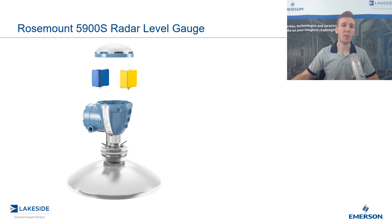So instead, this is why we have Rosemount's two-in-one system. This is a level gauge which consists of two separate and completely isolated and independent electrical units, separate wiring, but only one common antenna. And this is how we can utilize Rosemount's 5900S as both an automatic tank gauge for level measurement and a separate level sensor for your overfill prevention system. The most obvious benefit is the fact that only one process connection is required.